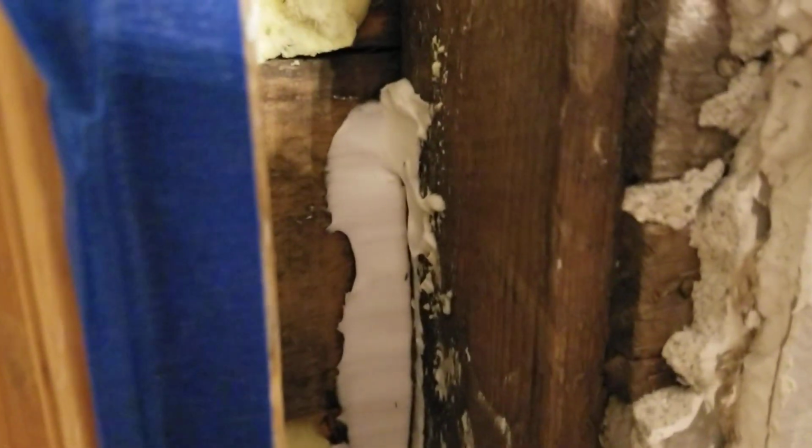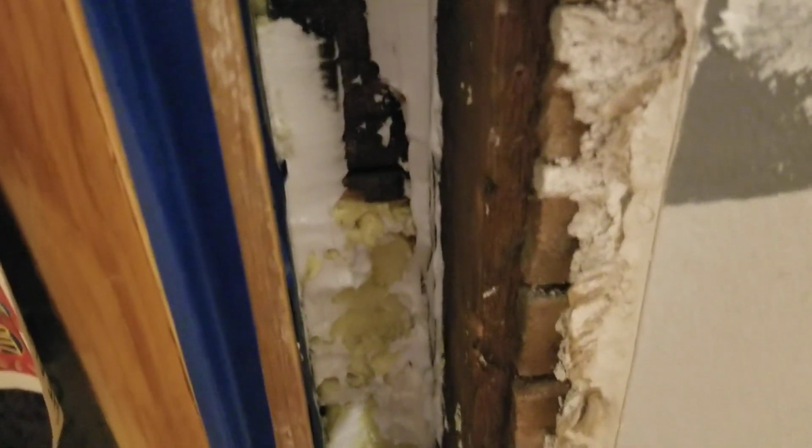And then come on down and you start seeing some caulking. This doesn't have to be a pretty job. In fact, you probably won't be able to get a caulking gun in there to do this. So what I was doing is putting a little bit on a stir stick from a paint can and spreading it in there as I went. That worked just fine. You can tell where the drafts were, where the caulking was. I checked this out when we had 30-mile-an-hour winds and it was -6 out. So that really tells me where a lot of the drafts are. I'm not saying leave your windows open until you get a real cold wind, because it's not practical if you're doing your windows.